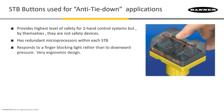Instead of a pressure that you have to hold — like other types of two-hand buttons where it's a mandatory pressure you've got to administer — all we're doing here in that little cavity is resting our finger in there, which at that point actually blocks the infrared beam that's going across. So it's very, very easy to use and very ergonomic so that you're not getting any type of pressures on your hands or wrist at all.